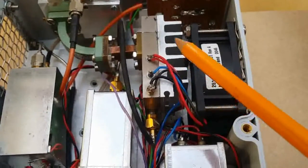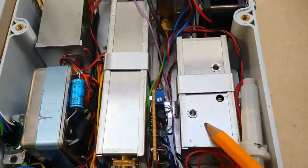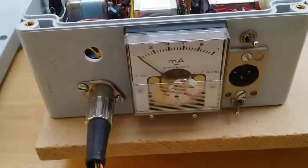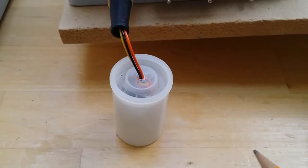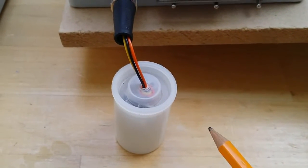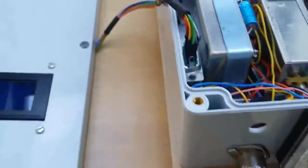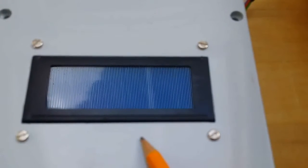Here is the power supply for the Toshiba module and a meter for measuring the diode current. In the film canister is an Arduino keyer producing CW sign dots and a continuous carrier in sequence. Connected by cable is an LCD panel which does housekeeping and tells you when the OCXO has reached temperature.